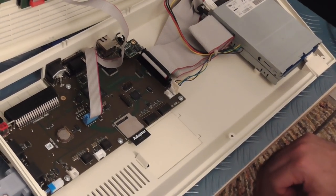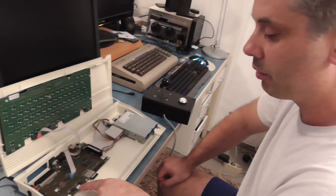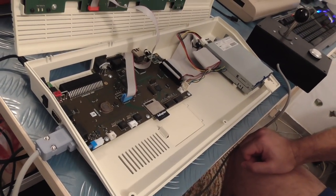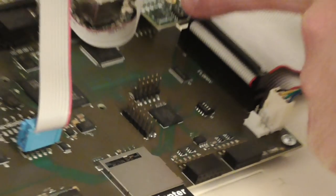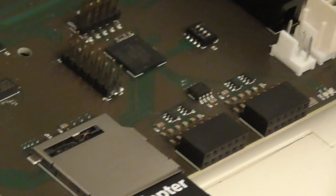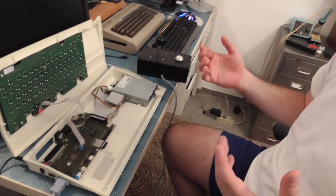We're not creating anything for that at the moment, but you could down the track if someone makes the VHDL for it. You can actually have a 5.25 inch drive on the cable as well and have that work as a 1541. There's some more expansion: this is the internal speaker, so we can have an internal speaker actually in the computer if we want to. And then this is an I2C header for low bit rate expansions. We've got the two FPGA debug connectors — this one's already got the programmer mounted on there — and an extra expansion connector connected to the smaller of the two FPGAs. DIP switches for some configuration in hardware. We've also got static RAM on the motherboard as well as battery backed, so we can have PAL or NTSC configured in there.